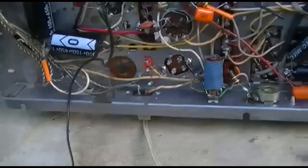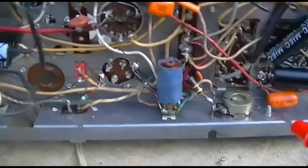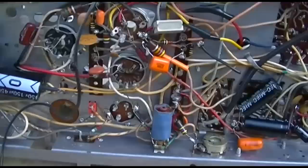All right, let's power this thing up before I glue all this together, before I silicone these down and heat shrink everything. I went through and I J-hooked all these capacitors and resoldered them so they're good. You really have to create a solid mechanical connection before you solder it. Don't depend on the solder to structurally hold two things together. That does not fly.